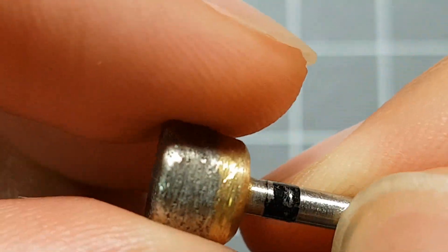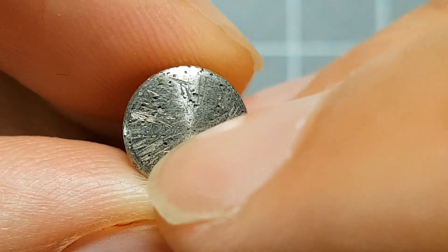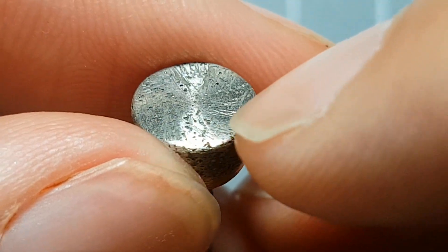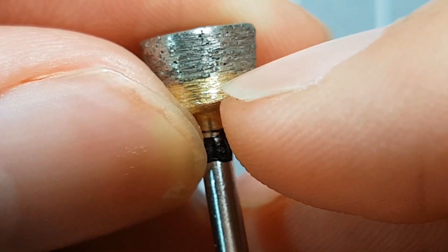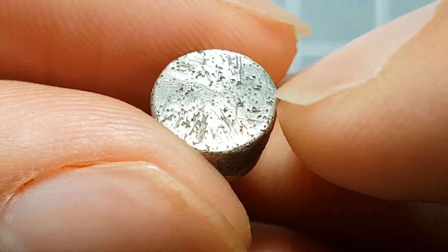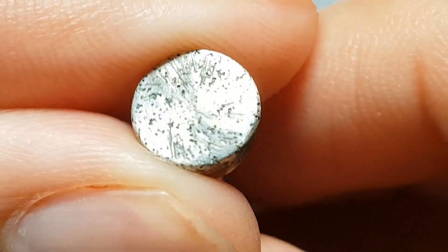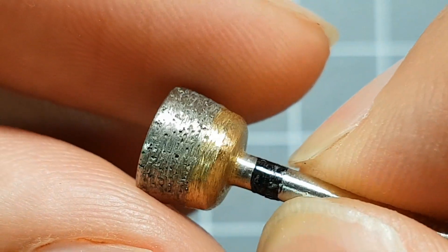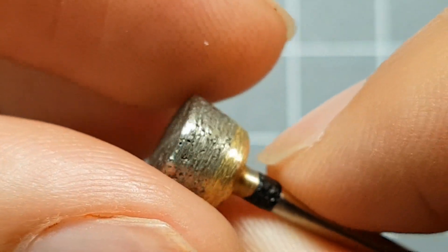Now the diamond sintered bit. It has smoothened out a little bit and it's copped a few deep scratches that weren't there originally. But the thing with these tips is that the diamonds just keep going through to the core — all of this is just a mix of metal and diamond. So even though it did do some damage, it just gets down to a lower layer of diamond. Think of it like Shrek or an onion — you're just peeling back the layers. It's put up a fight but there's just diamond underneath it, so it's smoother. The metal has definitely smoothened out a bit but it's just going to keep cutting like it's meant to.